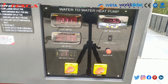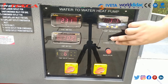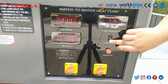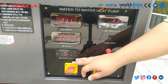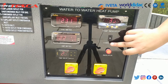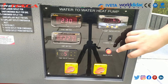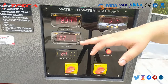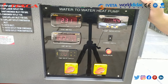After completing the setup, filling the water, and checking the flow rate, we note the readings for the first case. Using the channel switch, select T1, T2, T3, and so on. T1 temperature is 35°C; T2 is approximately 44.3°C; T3 is approximately 36.3°C; T4 is 19.1°C; T5 is approximately 34.1°C; T6 is approximately 35.1°C; and T7 is approximately 35°C. Corresponding readings for voltage, current, and time delay circuit should also be noted. Readings can be recorded at 10-minute intervals.